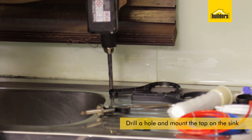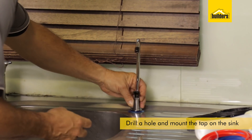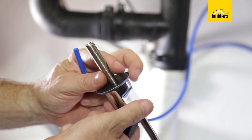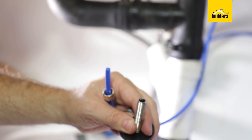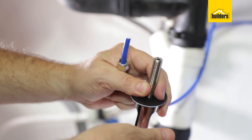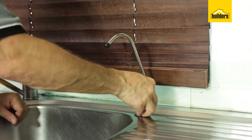The system comes with its own drinking water tap. I need to drill a 12mm hole into the side of my kitchen sink and mount the tap accordingly, then connect the pipe on the underside — this will be my filtered drinking water supply. The final fitting is connected on the underside of the tap: insert the nut, followed by the collar, followed by the insert to prevent the pipe from collapsing.